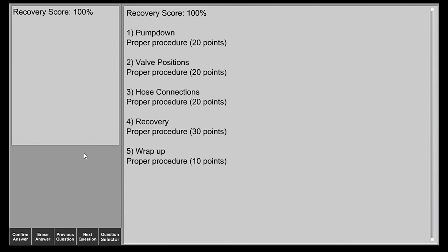You have options here — for example, we turned the starters off but didn't touch the main disconnects. There's nothing stopping you from shutting those off and applying lockout tagout for this reciprocating chiller recovery procedure as well. Feel free to leave any comments or questions and I'll be more than happy to help or make any necessary adjustments. Thank you.